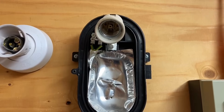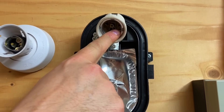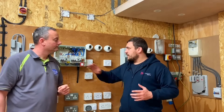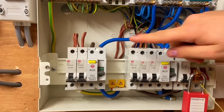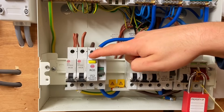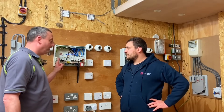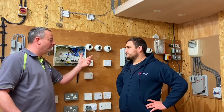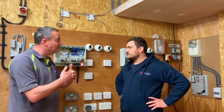If we hadn't done that first test, everything would appear to work as normal, but there are serious risks. Edison screw lamp holders will have their outer contact connected to the line conductor instead of neutral. Socket outlet polarity will also be incorrect. Most critically, all single-pole devices will no longer be switching the line conductor - they'll be switching the neutral. So in the event of an exposed conductive part becoming live, ADS will not disconnect the circuit breaker in the correct time. Effectively, the fuse is now in the neutral conductor, not the line - the outer metalwork can become live and the circuit may fail to disconnect.